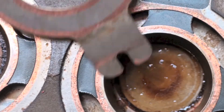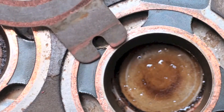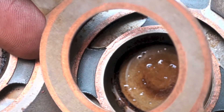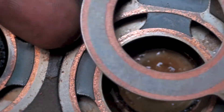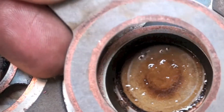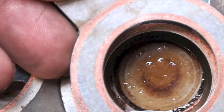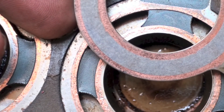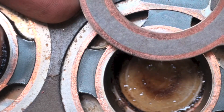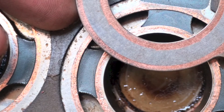You can see right there, there's a heavy copper plating, and there's also copper plating out here. The valve itself has got the same thing. I don't think I've ever seen one plated that much. This thing probably had a pretty dirty system, and that dirty system plus the temperature at the valves — which is about the highest temperature in the machine — sure did a job on this thing.